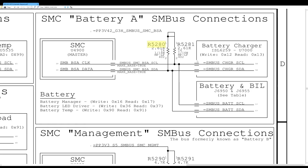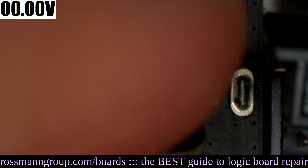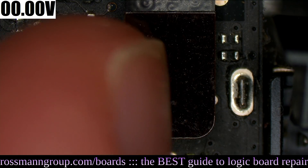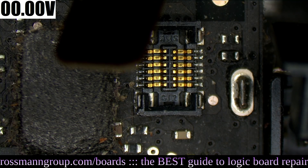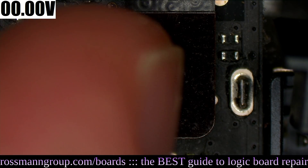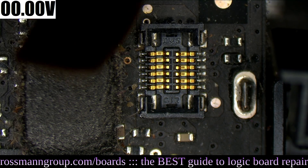If something is broken — if the battery indicator LED connection is broken and shorting the data line to ground — then we won't get communication, which is why I suggest removing it. So if you plug this in and get 12.23 volts, but then unplug it and get 12.56 volts, then you know that the issue is with your battery indicator, not with your motherboard.